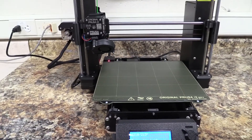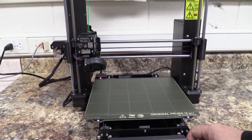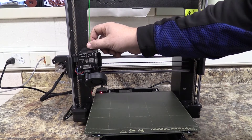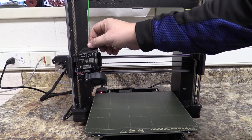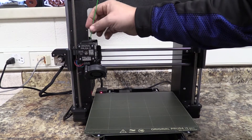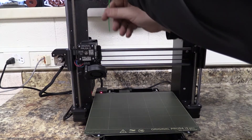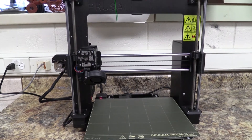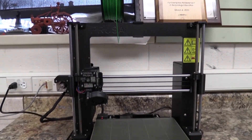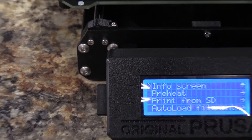So I'm going to come up here right now. It says press the knob to unload the filament. So when I press the knob, at the same time I'm just going to keep my finger on the filament up here — I always do that just for security. So I'm going to press the button and it's going to move the head up and then slide the filament out, and then I'll just easily pull it out from there. I did not have to pull real hard to get that filament out of the head. So now the roll of filament is free at the top, and the screen went back to the main menu because it's done unloading.